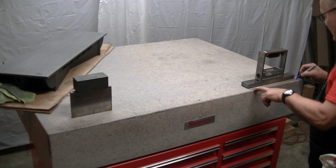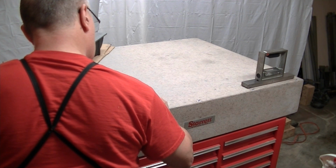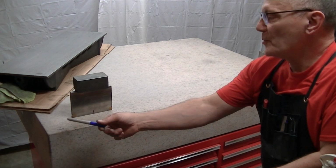Okay. And then if we come over here and translate this from 0, this is minus 2, so this becomes plus 2/10, and that would make this plus 8. Okay? So that's the information I was after. I was being very careful not to overhang a lot. I can see that I need to overhang more because I'm now almost a thousandth high. So this thing is concave.